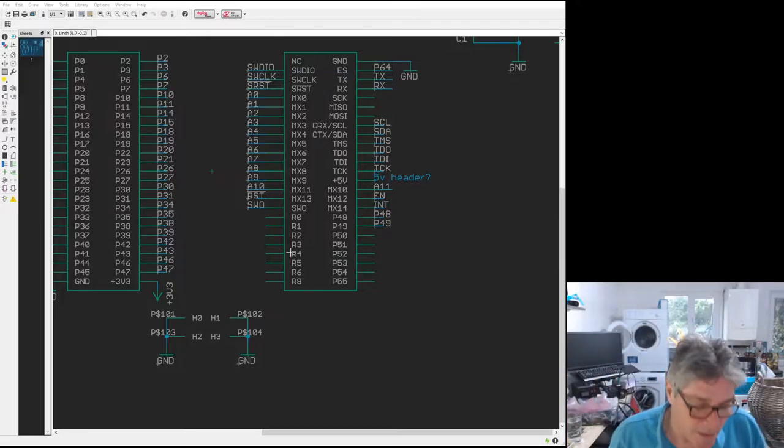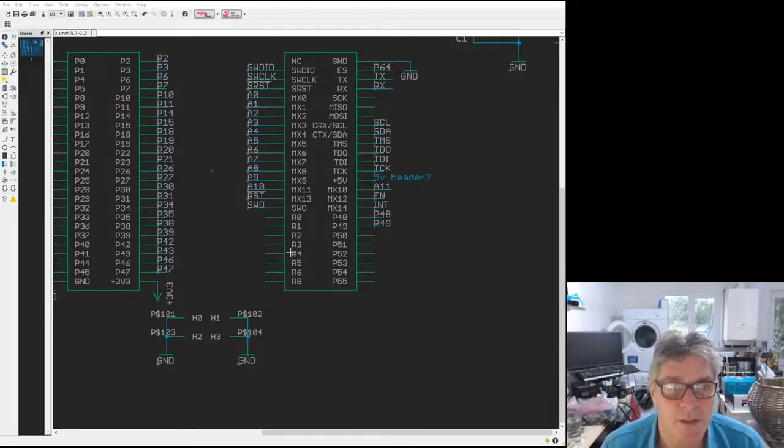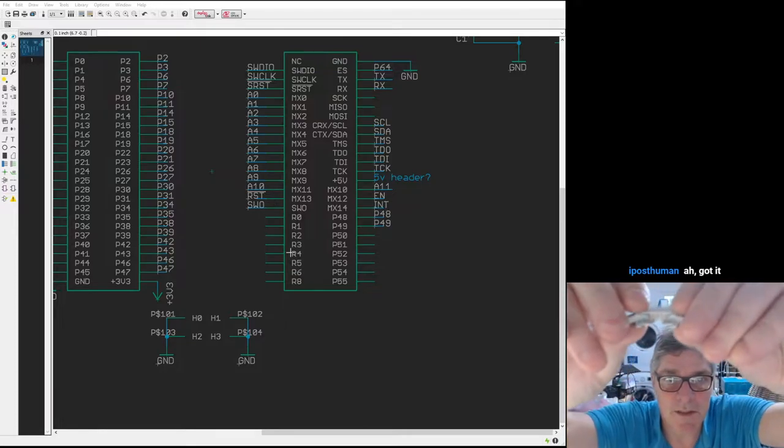These aren't shielded. You can get shielded ribbon cable, but you're better off using twisted pair. Shielded ribbon cable is a bit inflexible and awkward, and you need to do something fairly special with the ends, whereas twisted pair is fine. Don't forget it's an LVDS signal anyhow, so most of the common noise gets eliminated.